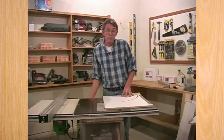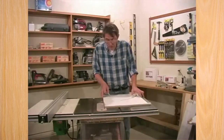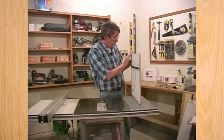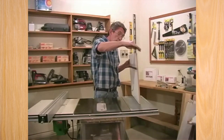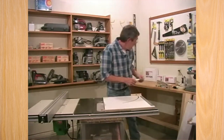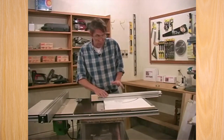Shut the saw. As soon as you've got the edge trimmed and the saw is off, stand that edge up, take a piece of 180 to 200 grit paper and just barely swipe that edge a couple times — just enough to break it. Now we're going to get the backstop, get our hardware pack, and show you how you actually start to assemble the W.